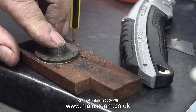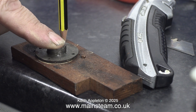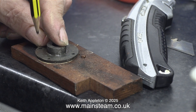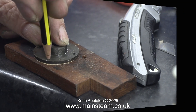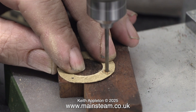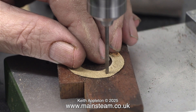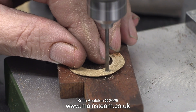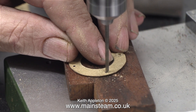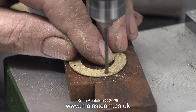To get the hole spacings added, it's very simple — use a pencil. The cylinder cover is automatically held in the right place by the central register sitting in the gasket hole. Then it's over to my small bench drilling machine, and it's quite easy to drill on the spots you've made with the pencil. A lot of model engineering jobs — in fact a lot of full-size engineering jobs — can be simplified. You don't have to use rotary tables or DROs.